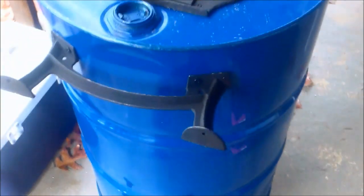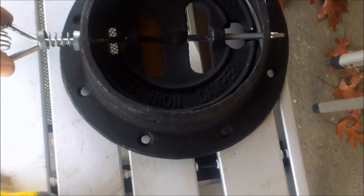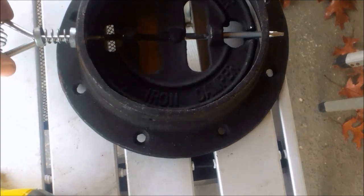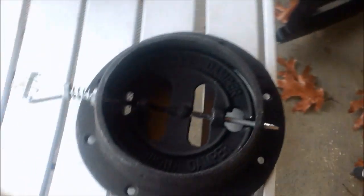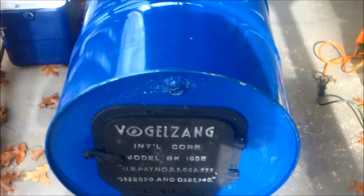So now we're going to worry about the damper. This goes to the flue pipe, and it's cast iron. And we're going to trace that out and drill it out. The way I laid my buck stove out was seam side up. 55-gallon drums have a seam, and the reason why is you don't want all the heat of the coal sitting on that seam and loosening it.